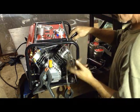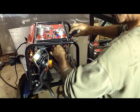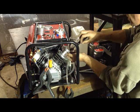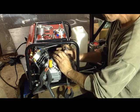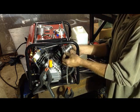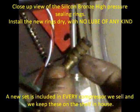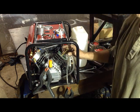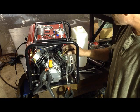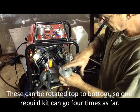Don't over-tighten the screws — make sure to put anti-seize on them. There's a gasket in between here; we're going to break the seal on that by rocking it back and forth gently and pull it straight up. Now we can see the piston rod for the high pressure. You'll notice we have four silicon bronze rings — not o-rings, not rubber or plastic — these are silicon bronze, similar to a piston ring in a car. There's a little gasket material to clean off.